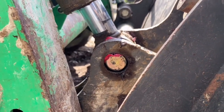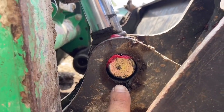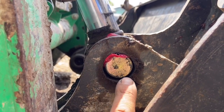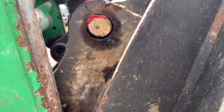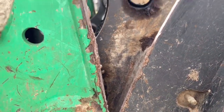I decided I'm going to skip replacing the bushings right now, because if you notice how much slop is in this actual Bobtach, I believe that's where most of my play is coming from. You can see the room around here. The pin's got a decent amount of play on that side as well. Let's check the other side.